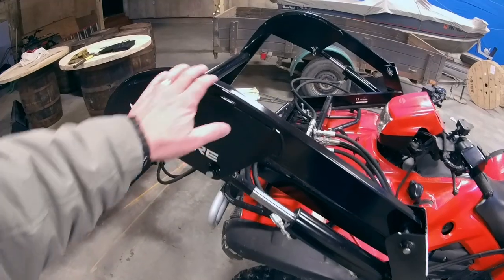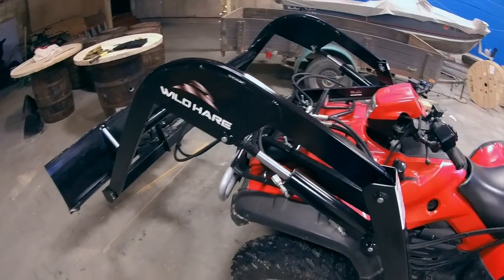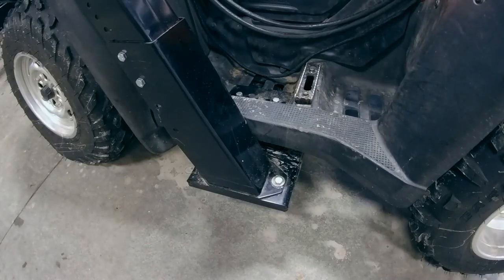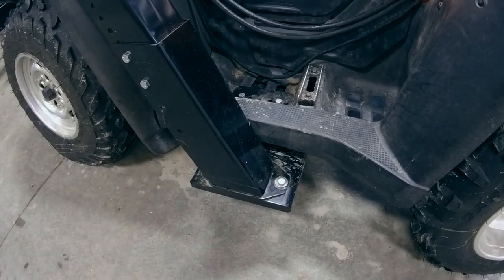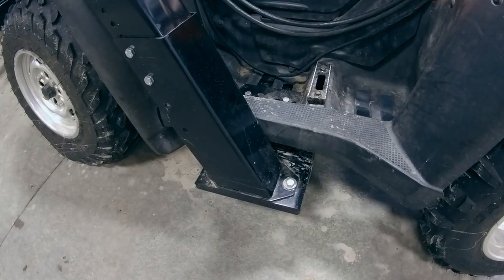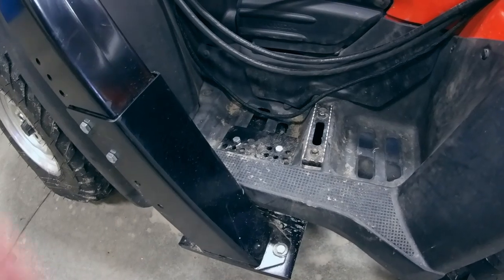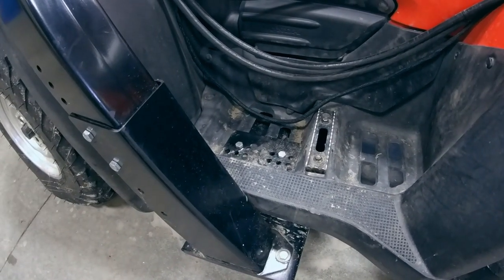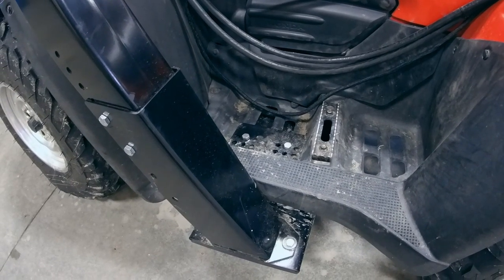As you can see it's extremely robust. Most people when they remove the loader just remove the two bolts here where the feet attach to the cross plate and leave that permanently mounted. But it's easy enough to remove the two bolts on this side and the two bolts on the other side at the footrest, and the cross plate drops right off.